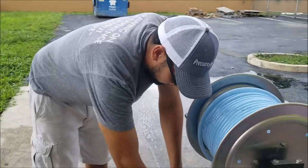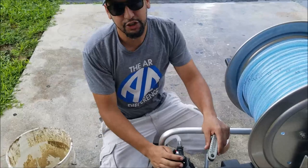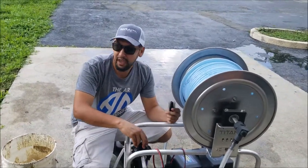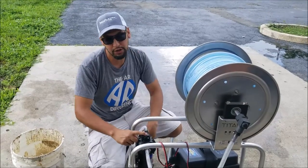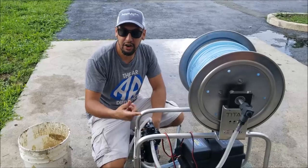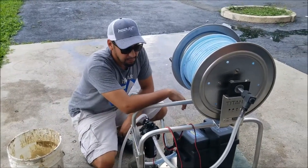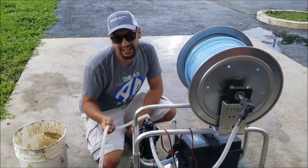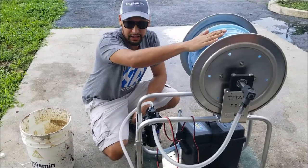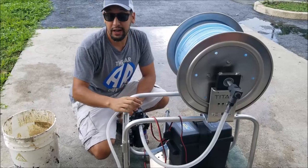Another few things I'm gonna throw at you guys about this pressure switch. This is probably the part that fails the most for most people. Because it's cycling on and off, and maybe you're not noticing it because they're up on the roof or wherever the case may be. Depending on the viscosity of your mix, some people use more surfactant than others. It gets a little thicker. That's gonna change how everything works, which is why you kind of want to adjust this.